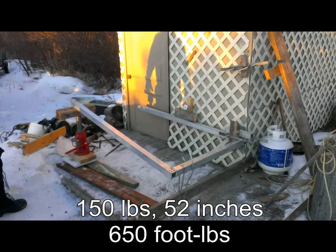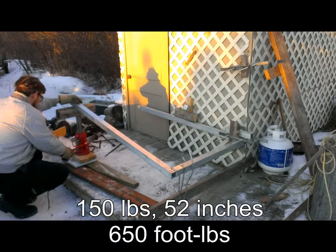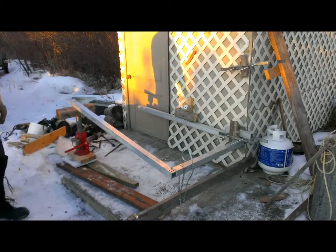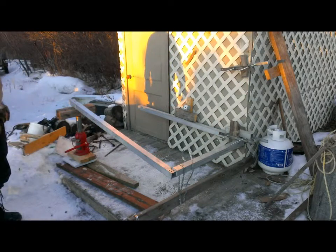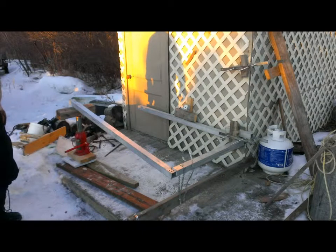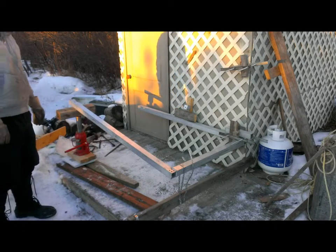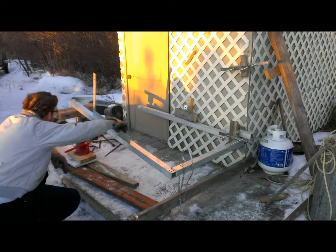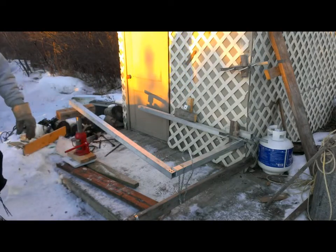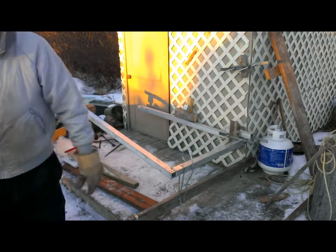24 pumps to get to 150. We're at 151, and I got no more hydraulic ram left. So 150 times 4.5, we're at 700 pounds-ish, 700 and something. So it's doing quite well. Again, I'm actually seeing a measurable deflection in what is supposed to be a solid bead. So we'll stop the video, I'll drop the hydraulics, I'll add more spacers, and we'll continue.